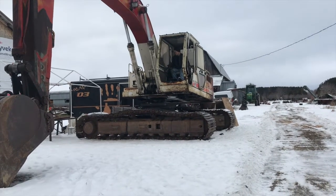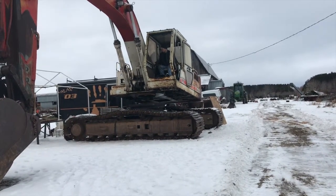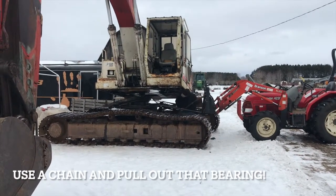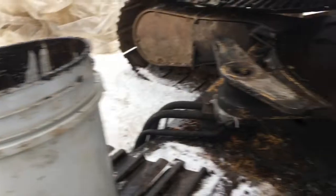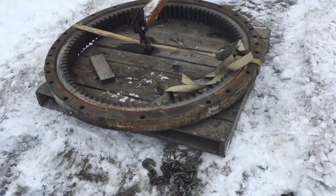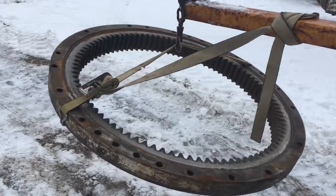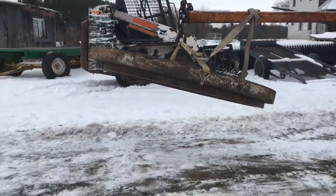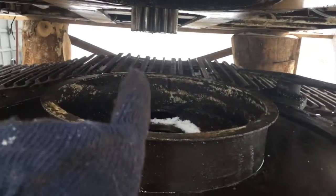Good luck with your slew bearing. We're going to do a little lift and see how she comes out. I gave it a good cleaning — got a little pail of junk out of there. Scraped the top all nice and clean, and also cleaned the bearing in the shop. Wire-brushed the bottom side because it was upside down. Now I've got a little Ginny Boom arm and I'm going to lift her up and set her in. I played quite a bit with the lift position so I can get the bearing to slightly hang on this side — that way when I walk it into my shovel, it'll hang a little higher so I can go over top of that center joint and in front of the gear.